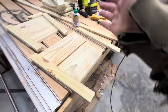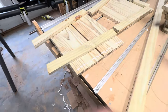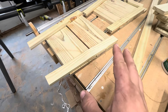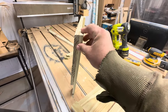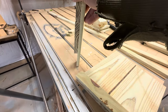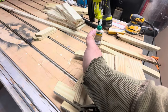So that when it sits up, the bottoms are flush against the floor and the tops have a nice flat surface. We're going to put some Titebond 3 down along the strip seam, then flip it over, line it up, and brad nail it with one-inch brad nails to hold it while the glue dries. On this one I just put together, you can see one flat surface here, and then the bottom piece will be nice and horizontal to the ground so we can put a bottom piece in.